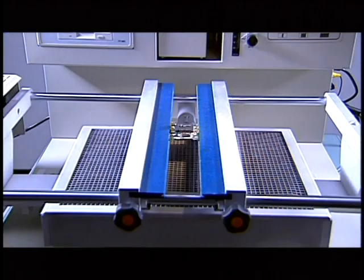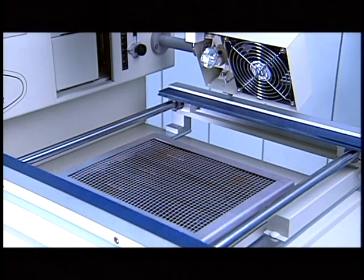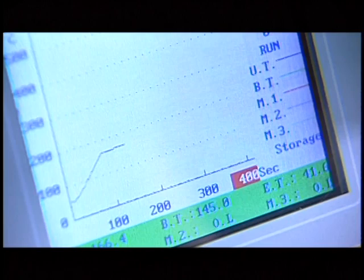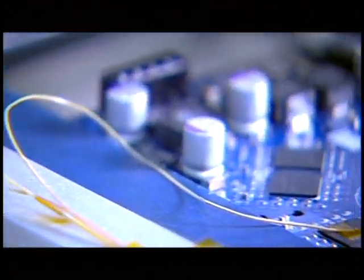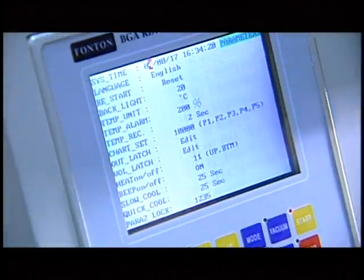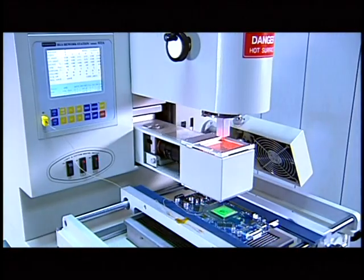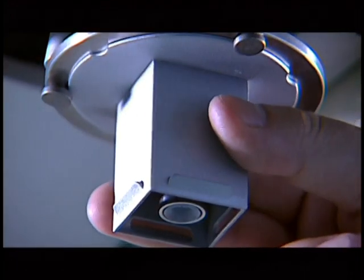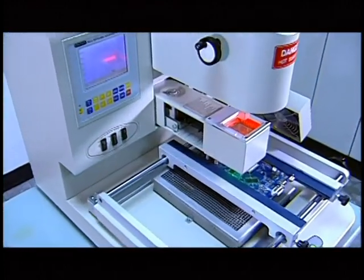Fontaine's BGA933A is the reflow equipment with high efficiency, high precision, and multi-functions, designed particularly for small-sized BGA devices. The maximum clamping size is 410 by 350 millimeters. BGA933A has applied the new fuzzy industrial-level controlling system and color LCD monitor that can build in 99 sets of memory modules, letting the operator set up parameters of temperature, time, flow rate, and luminance directly over the control panel, with quick online operations. BGA933A also provides a unique cooling system and extra-large bottom preheating system that can divide the PCB into two heating zones and heat them up independently.